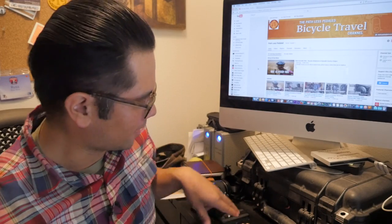That's it for this video. I hope it cleared up the confusion about whether or not you can use these 501 plates. I guess I was both wrong and right — it just did not work out of the box. But you can remove the grub screw, and as long as you slide it in in the opposite direction, it'll work.